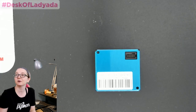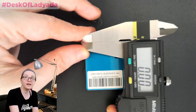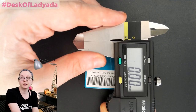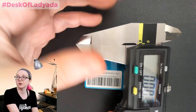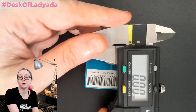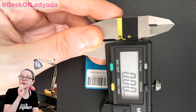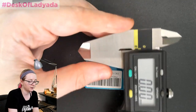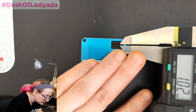Let's go back to the overhead. This is our sensor whose datasheet had no useful connector information, and here are my calipers. There's one thing you've got to watch out for: you don't know whether the connector is metric or imperial. Whenever you're finding out a new connector, unless you already know it — like 'oh it's a standard 0.1 inch' — it could be metric or imperial. So you want to be careful with your calipers to figure it out without going over or under.